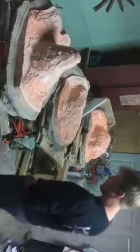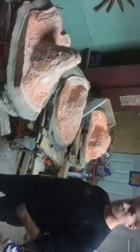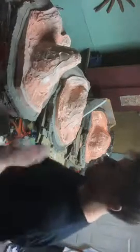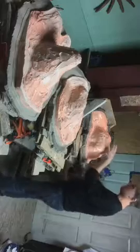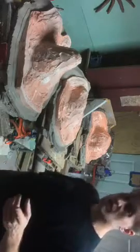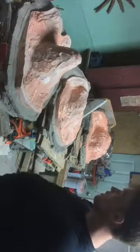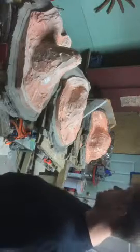So we're going to work on getting the prep work done for fiberglass again. In these molds, and I think you can see them a little better now, we haven't done much since the last video beyond building our silicone up and getting lots of coats. You can see we got the third one siliconed and ready for glass. It's finishing drying now. It'll be done in probably 45 minutes or an hour. I talked last time about fast cat and fast kicking in the silicone. The first couple coats we absolutely did not want to use it because that's where my detail is, where I don't want it to rip.